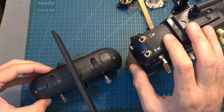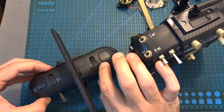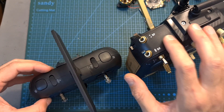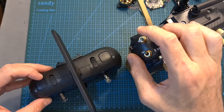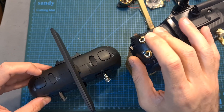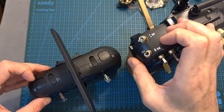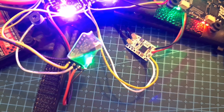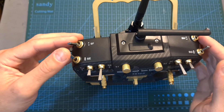One important aspect which is only applicable in case you're going to use two radio controllers is that before switching between the radio controllers, pay attention that the auxiliary switch on the secondary device is set accordingly. For example, if these two switches are set to control the VTX power switches, before switching this one make sure that this one is pressed, as otherwise we are going to enter a ping-pong game between the two receivers. In case you're going to use a single radio system however, this is not going to be an issue.